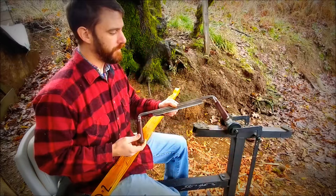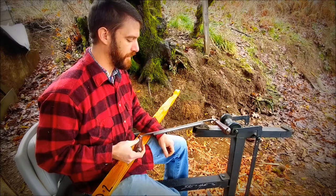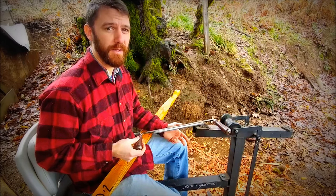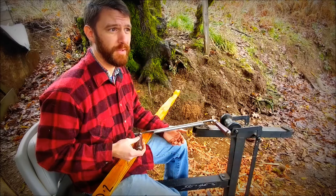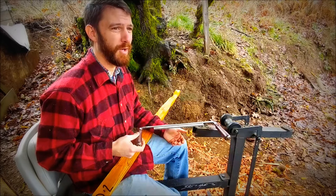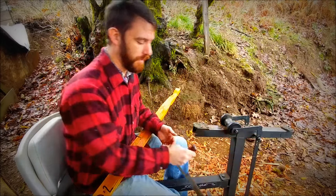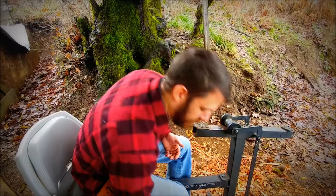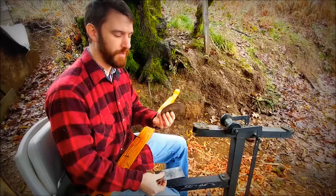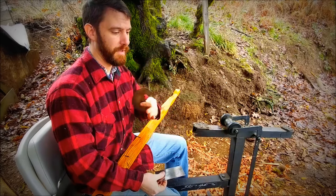The primary tool you're going to be using is a draw knife. There's some debate out there between what works better for chasing rings — a dull draw knife or a sharp draw knife. I think they both work fine. You just have to be careful with a sharp draw knife that you're not being so reckless that you're going to tear down through the next layer. But in all reality it's kind of hard to do that unless you have really thin rings. I use a sharp draw knife and I don't have any problem chasing my rings. You're also going to want a scraper to clean things up and to work around the knots, and I have this gooseneck scraper that's going to be helpful for getting in those dished out back areas.